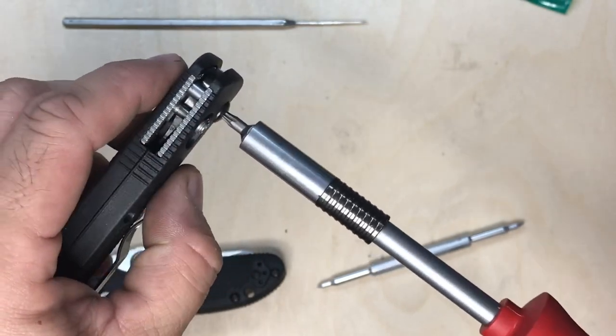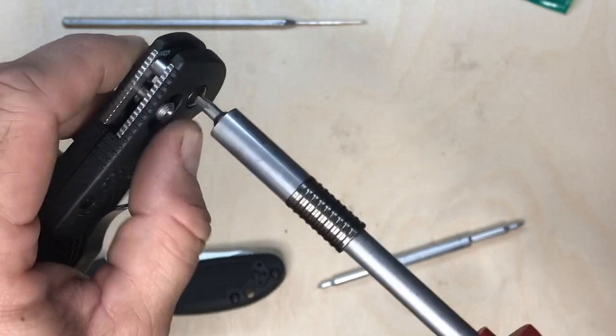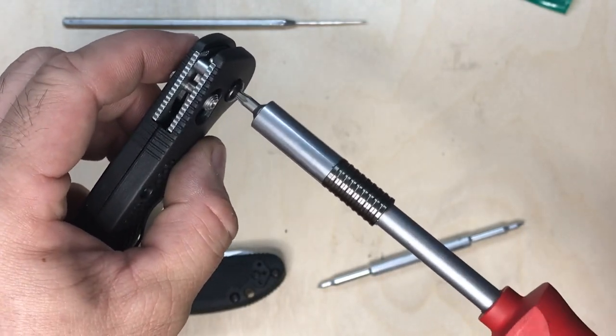If you have a very well-used knife you'd be better served to unscrew it a few turns and then push it with the screwdriver. As you can see it finally broke free but it may have to overcome some stickage. It's better to push with the screwdriver because it's better for the pin itself too. So unscrew, push a little bit more, and then finally just unscrew all the way out.